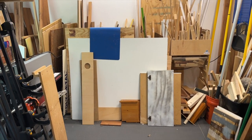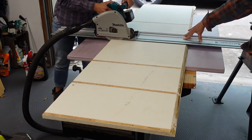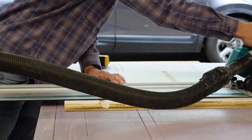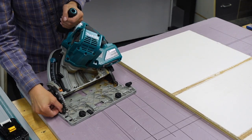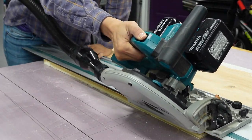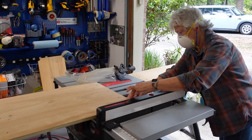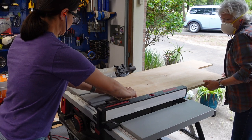For this project, we just looked through our scrap wood and found a couple of pieces of 3/4 inch plywood that would work. We started by ripping our scrap wood into manageable pieces. We used our Makita track saw for the majority of the cuts. The most difficult part of this build is the angle of the front edge — the front two edges need to be 45 degrees. I'm setting that angle on our track saw and making the first bevel cut. We also used our table saw for some of the final cuts, including a 45 degree angle. There are a lot of different saws you can use for these cuts, so use what you have, as most saws have the option to cut at different angles.